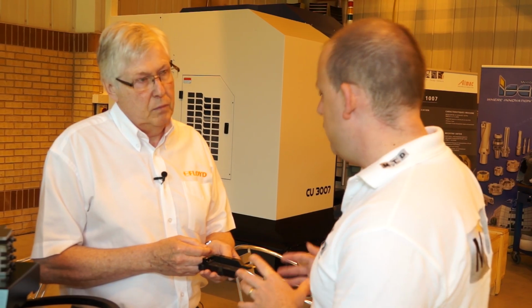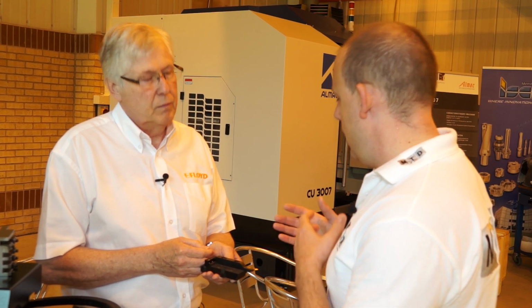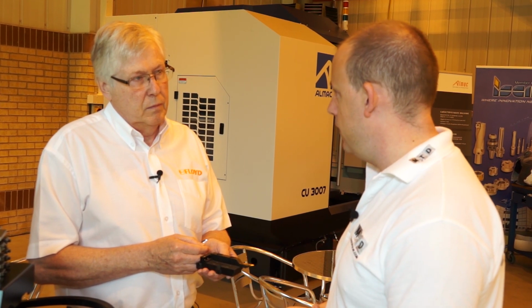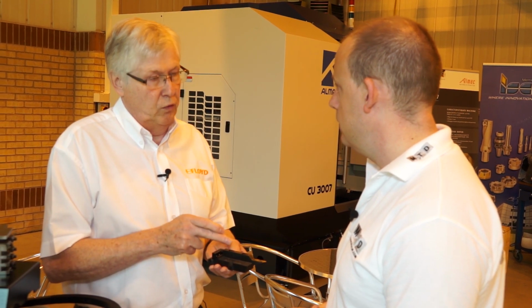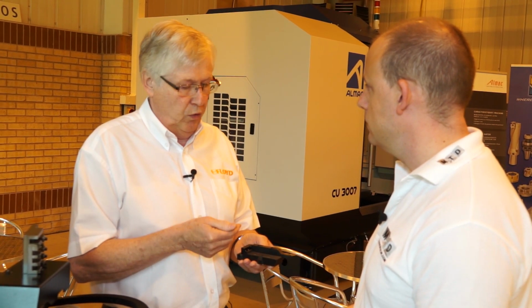So that's all very well, but with the sliding head lathe, you're obviously going to need lots of different tools. So is there a variety in the tool holders that you can actually use on? Yes. I mean, you can use the actual Applitec twin screw system, but there are also tool holders for ISO and also for centre holders and knurling tools as well. So how easy is it to actually take apart?